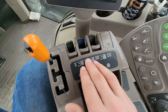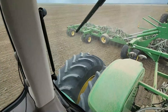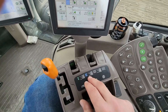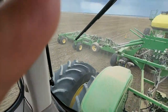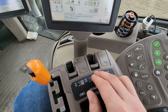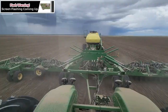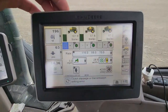These three switches up here are actually our hydraulic remotes. The first one is used the most — that's for the up and down of the discs on the air seeder. The second one we don't use a lot; most of the time we have it covered, and that's for winging up the entire air seeder for transport mode. Obviously most of the time we're in normal seeding mode. The last one here is just for turning our fan off and on — most of the time it's clicked in the on position so the fan is always running.